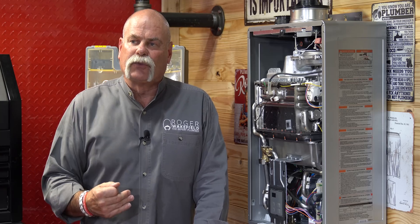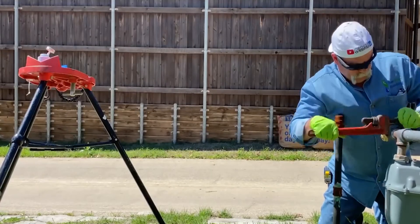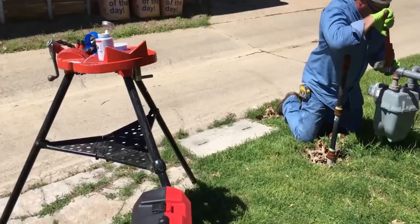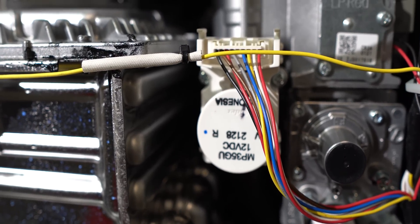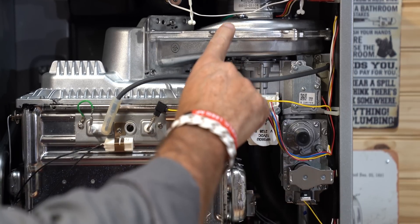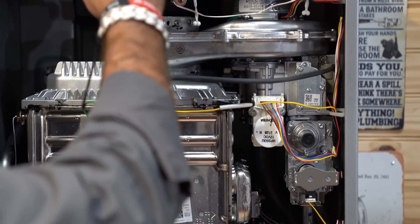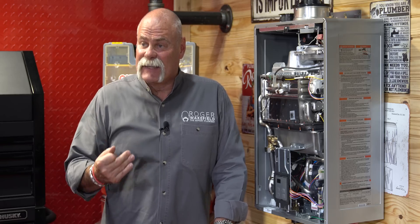I had a customer who definitely wanted a tankless water heater, but their gas line was so small they couldn't get enough pressure and flow — we had to increase the meter size and the line. But they understood the value and ROI, were happy to do it, and they love it to this day. Due to the Venturi and fan inside, if your pressure is not quite as high as it should be — but high enough — this tankless will work where some other ones will not. Always check the code book so you know what's required.